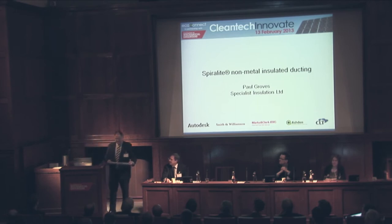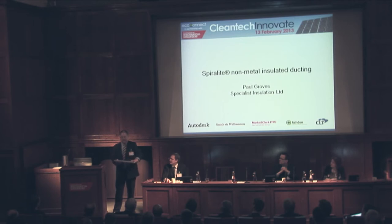We're very proud of the product. Just to give you an idea of how it's made: we take a very high-quality insulation panel, which we get from Kingspan, who have a very good insulation material. We cut routes into it — 18 routes. We lay a fully applied laminate over the top and turn it into a duct. It's that simple, it's a very simple process.